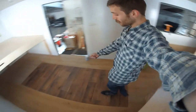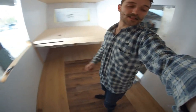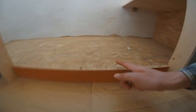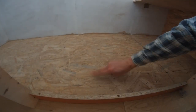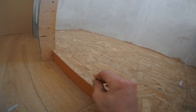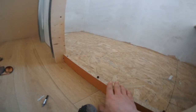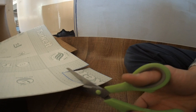For the bathroom I got a nice new vinyl flooring which is a bit darker with a very grainy kind of wood look. I prepared the bathroom already with a little plank here to have the waterproofing tub in — the vinyl will wrap around 10 centimeters high. I cleaned the bathroom floor and I'm finishing the mounting of these screws so this will be tight and I can add the waterproof flooring. Because I want the vinyl to go up 10 centimeters, I'm cutting out 10 centimeter squares out of the corners.